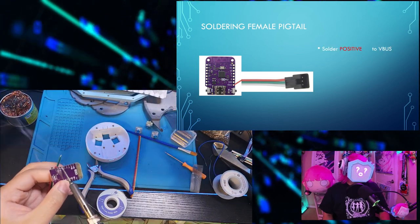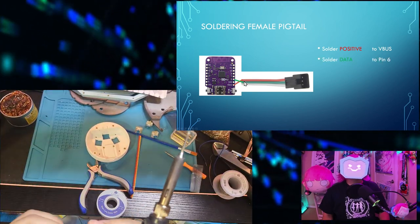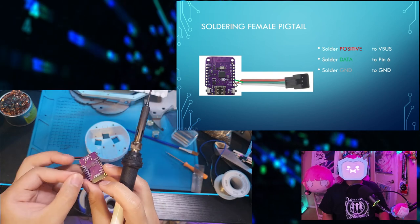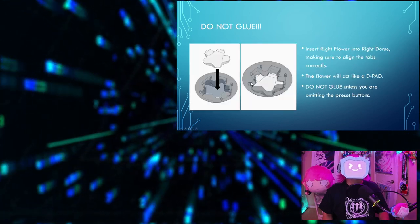Okay, so solder the positive red wire to VBUS. Solder the data wire to pin 6. And solder ground to ground. Note the order of the wires because they will cross.